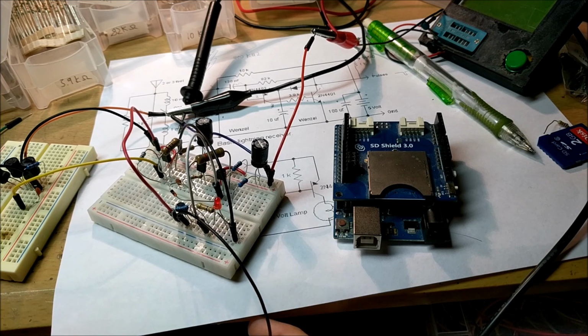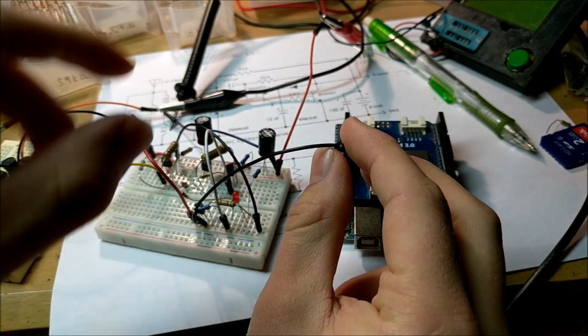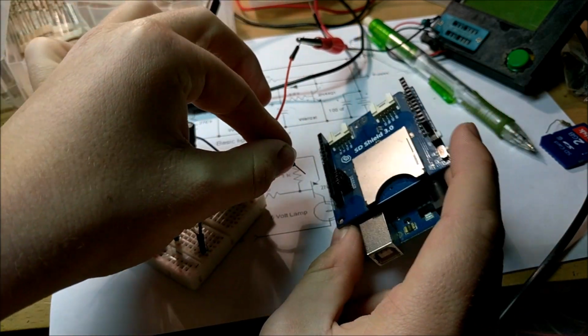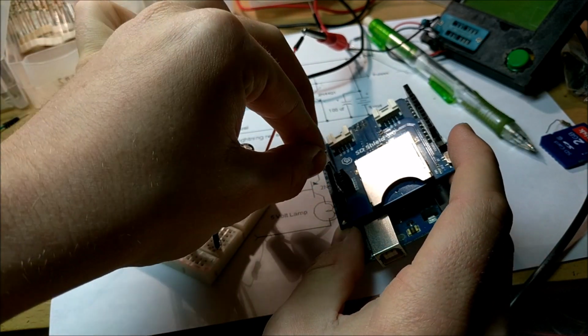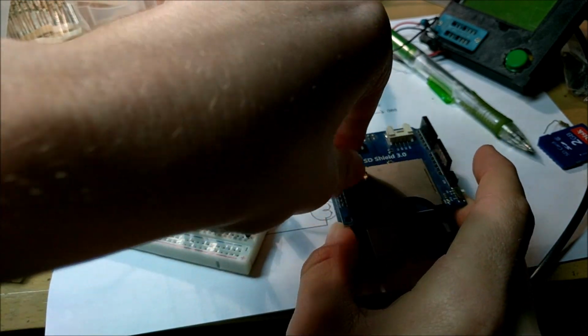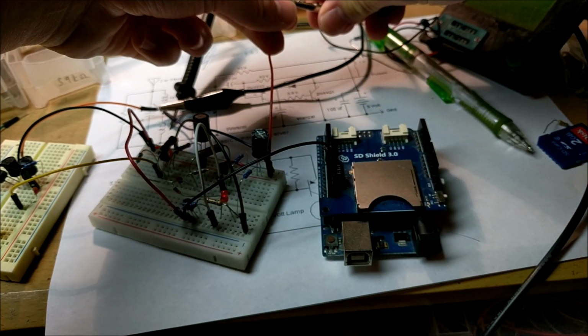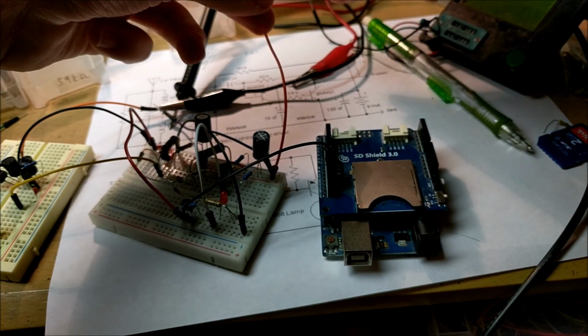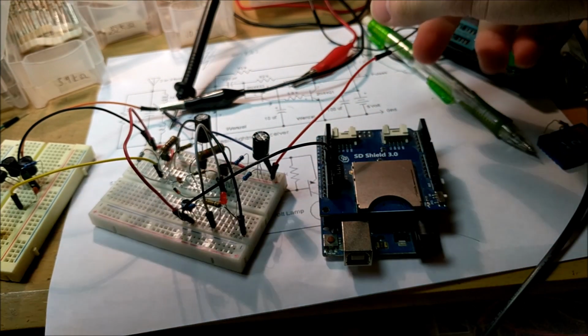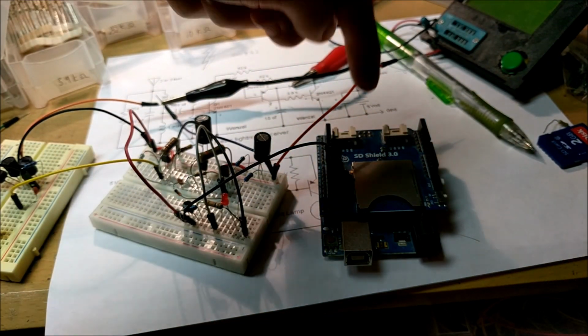So what I'm going to do is take an Arduino Uno, take the multimeter out pin, and insert that into pin 10, so that we can get a digital input reading of 0 or 5 volts. There we go. And then we can also take the outputs that are going right now to the power supply, and we can actually insert those into our Arduino too.